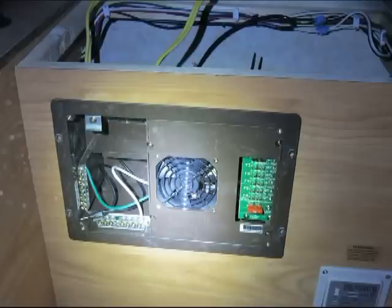And then you have four screws to anchor it to the wall, same as the old one, and I just self-tapped them in there, so that wasn't any big deal. You can see the fuses are missing in this picture because it doesn't come with any fuses. You can take the fuses out of the old converter, or you can go buy some new ones. The fuses are fuses, though. They don't get old or stale or anything, so use the old ones. You might need more. As I said, there's more wires on this one than the old one.